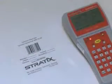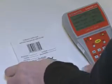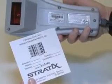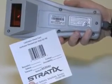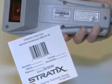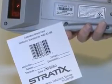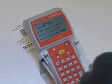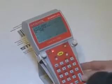The verifier comes with a calibration check card. Before conducting the calibration check routine, make sure the serial number on the card matches the serial number on the verifier that's being used. Once the serial numbers have been confirmed, be sure that the verifier is set up in full ANSI laser mode with the stand, and that the UPC mag is set to 100%.